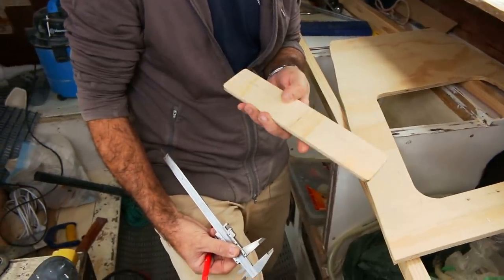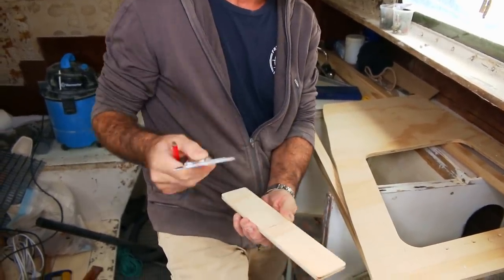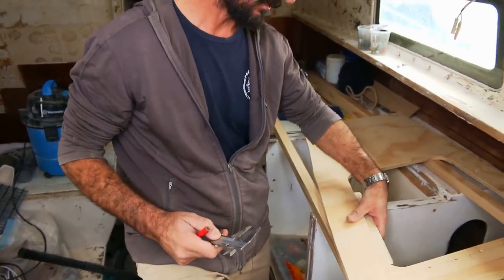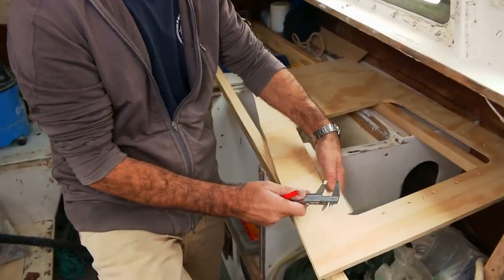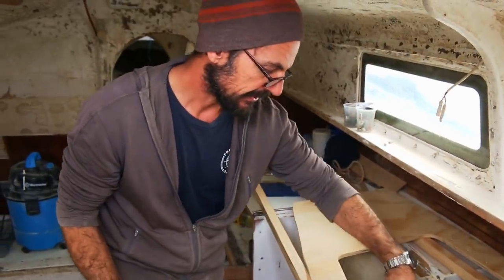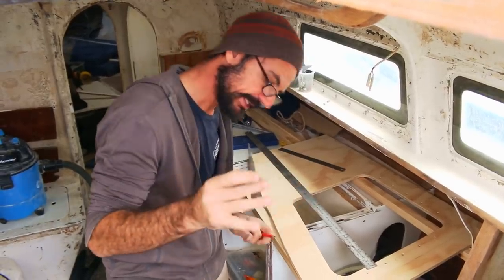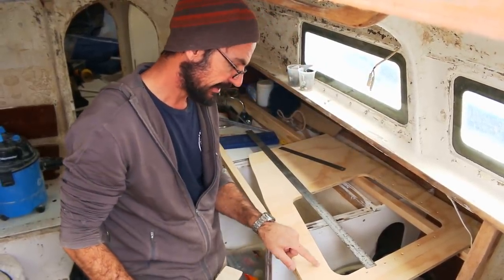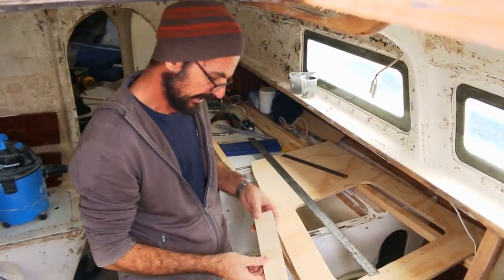These pieces for the lip are 60 millimeters. I'm marking in 20mm from each side — one line is where I'm putting screw holes and this line is to line up with the lip. One third will be sticking out and halfway between the two bits that are in there is where the screws will be — plenty of meat in there. I'm using my verniers set to 20 to speed up layout. That little tool is a spring-loaded center punch — backed right off for plywood. When you hear the crack, you know it's made a little hole in the timber and that makes it really easy to locate the drill bit.